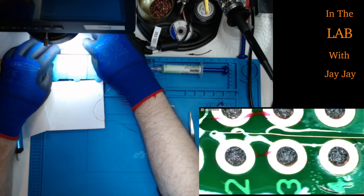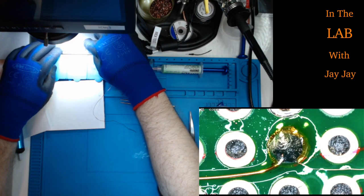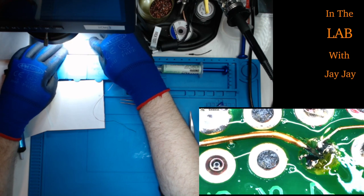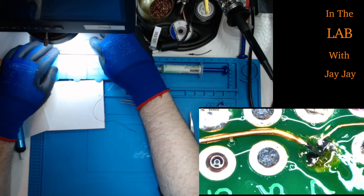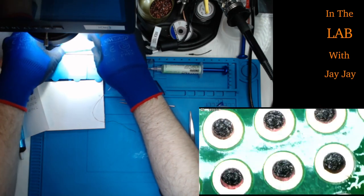And it comes along here to that one. That looks alright. It's a bit ugly. It's functional. Look how small that first bodge wire is. This is the medium one along to here, and that looks okay. We'll reflow it, but it basically looks like it'd be working. And then here's the short little one over to here.